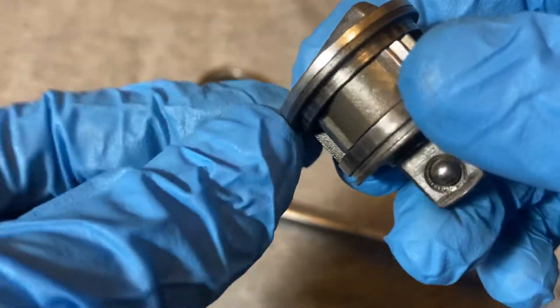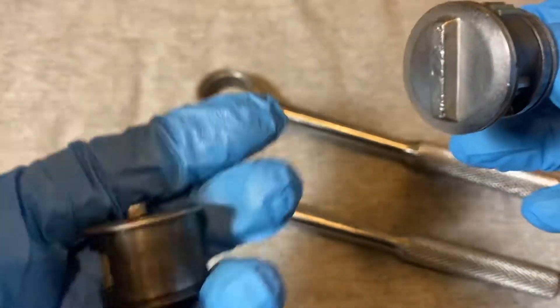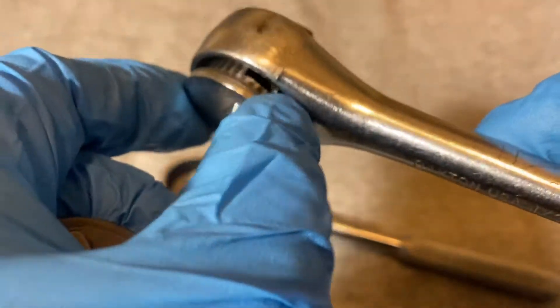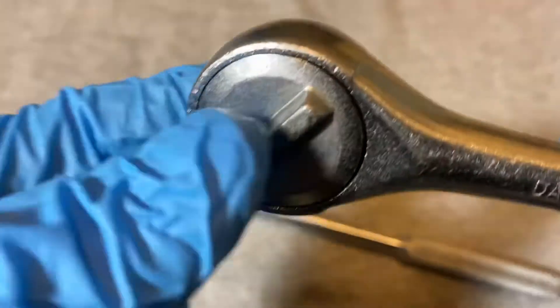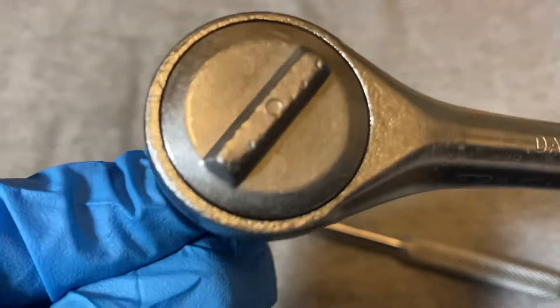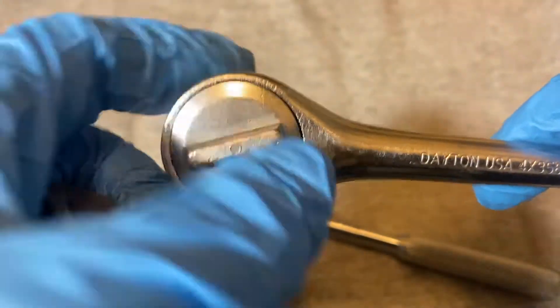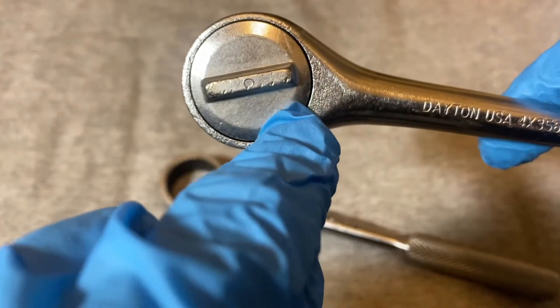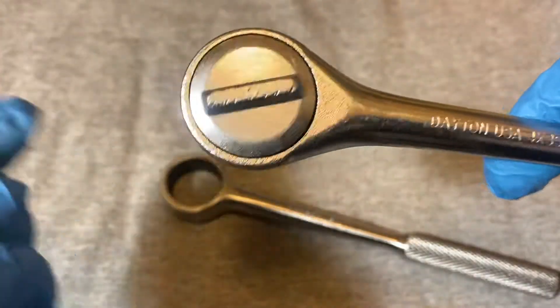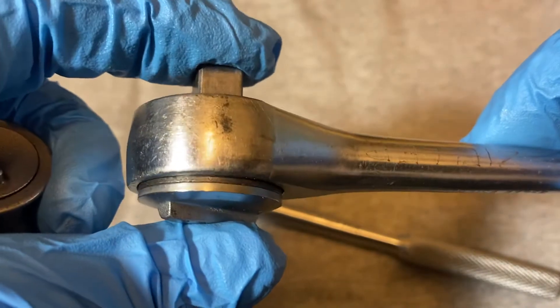As you can see, this switch goes all the way to the edge of the mechanism. I think this was probably the first or an earlier mechanism, and the other came out later as an improvement. Because if the switch makes contact with the edge and there's a good amount of pressure being exerted — the anvil is probably gonna go to one side — and if you're switching with that force, there's a possibility that switch will grab the side and could switch on its own. I think that was probably a problem with this type of switching mechanism.